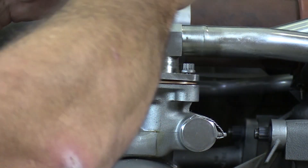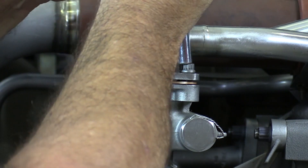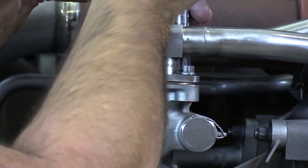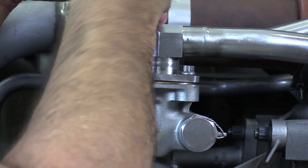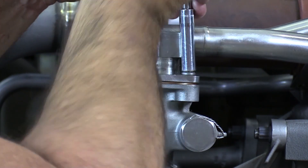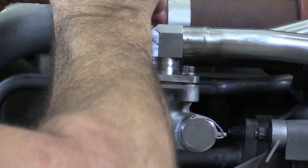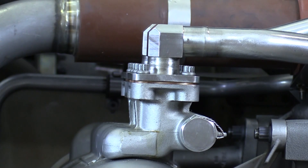I've run my four bolts down by hand. Now I'm just going to snug them down, get them into a position where we're ready to apply an actual torque value. Notice I'm tightening these bolts in a crisscross pattern. Anytime you have a fluid line flange like this — four bolts, six bolts, whatever — always tighten in a crisscross pattern. Now they're just snug, and now we'll repeat the process with the torque wrench and go to whatever value the AMM indicates.